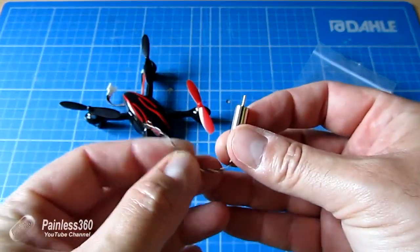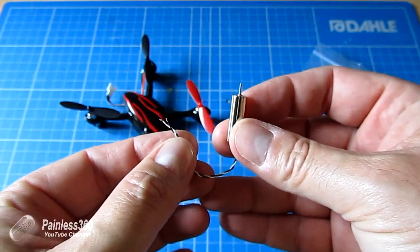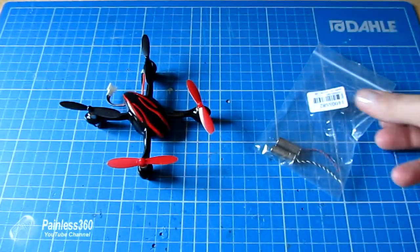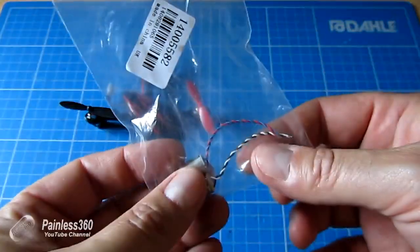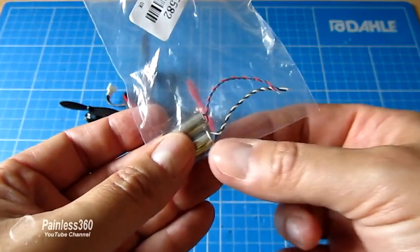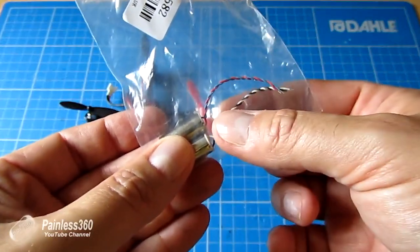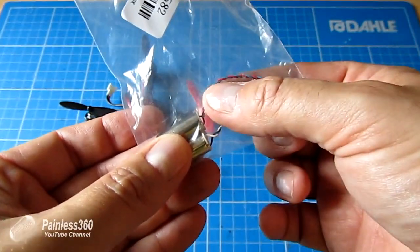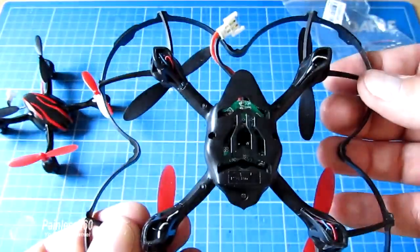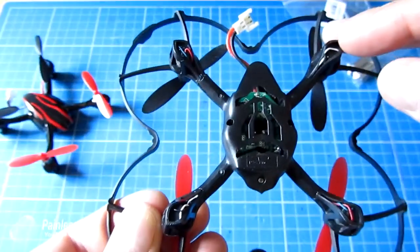They all use a DC motor, and we know it's a DC motor because it only has two wires coming out the bottom. Typically when you order them and they come in the pack, you'll notice that you get two versions — a clockwise and a counterclockwise one — denoted by the colour of the leads, either white and black or red and blue.